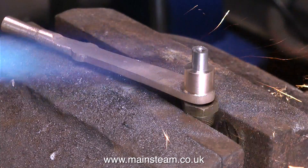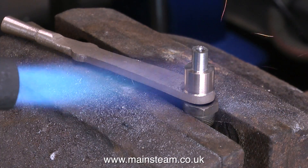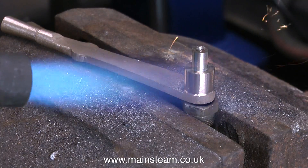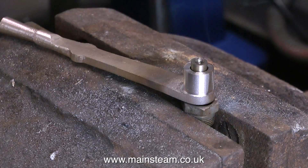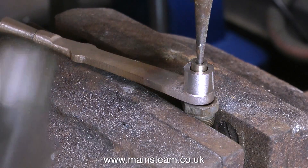Over now to the outer part of the workshop, and I've put an old pipe union in the vice. It's time to remove the 5/16ths of an inch diameter mandrel from the reversing lever. I'm doing this by heating up the part with the blowtorch until the Loctite 603 gives way. It doesn't take too much heat to destroy the bond — you certainly do not want to heat the part to red heat — and with very little effort I can tap the centre mandrel out of the reversing lever.